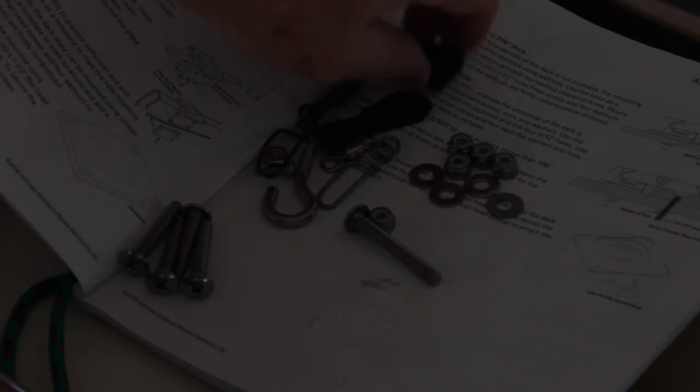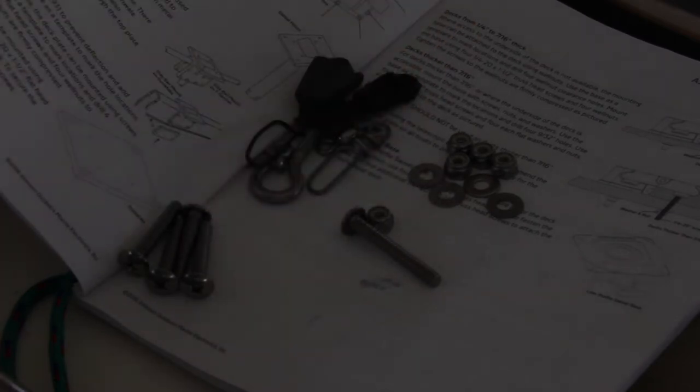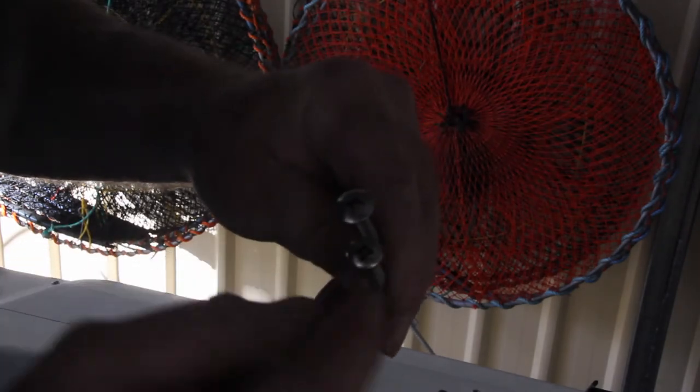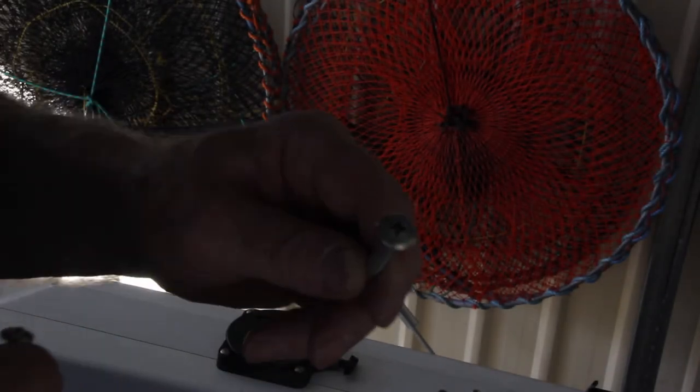I'll just take you through the contents of the packet. I've used four of these long screws — there are five of them. There are also five nylock nuts: four for attaching the plate to the side of the boat, with four washers to go with them. There are four shorter bolts for putting the swivel base to the quick release. And then you've got your terminal tackle and hook for hooking it all up. Just be aware that although the two-inch bolts are all the same length, one has a different — slightly smaller — head. That one is needed to put the boom into the downrigger unit. The other four with the same head are used to fasten the deck plate on. Don't get them confused.